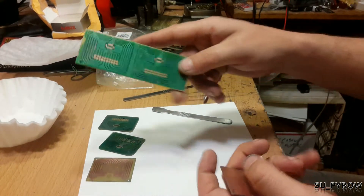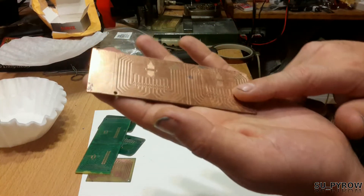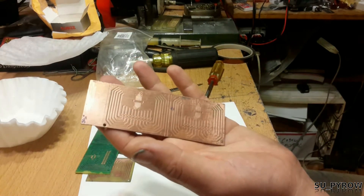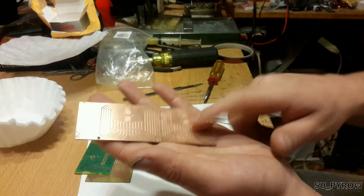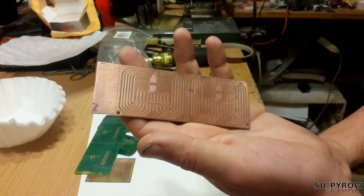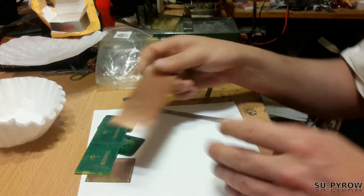Here's another one that didn't pass. There's another one — this was actually a mess up on my part. I had to deal with size constraints and the quality of my printer. I forgot to do the negative on the resist, so I was actually etching away the traces. I stopped it, but it was too late.